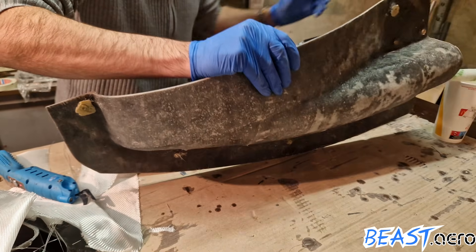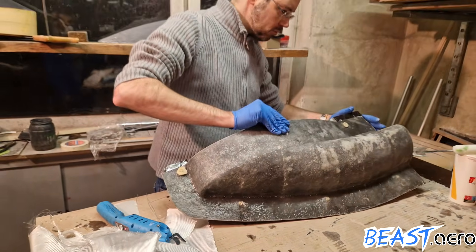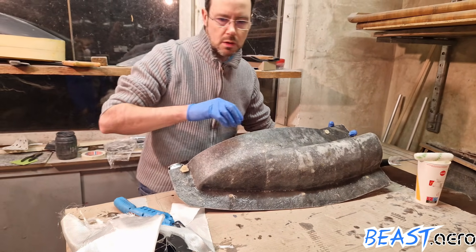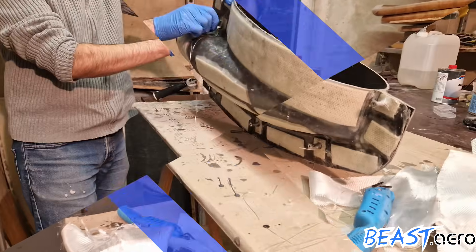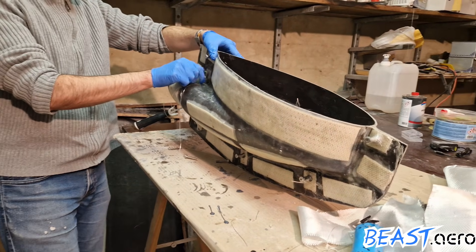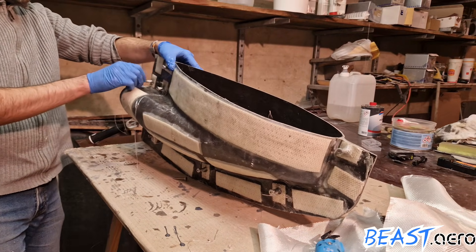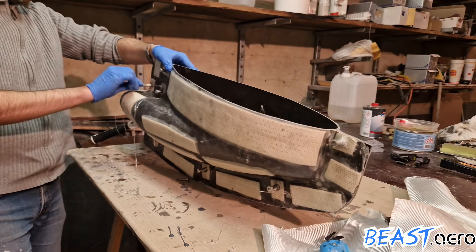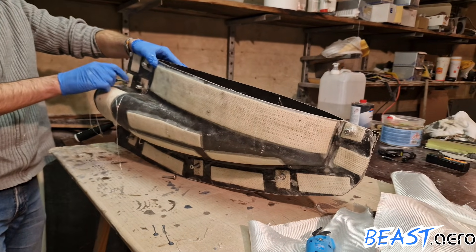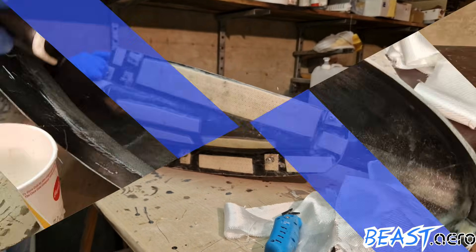Finally, I am assembling together the two mold halves. We are using screw inserts which act as guiding pins and also hold together the two mold halves. Just three more screws and then the forms are connected — and you know it's always the last one which wants a little bit of extra tension.